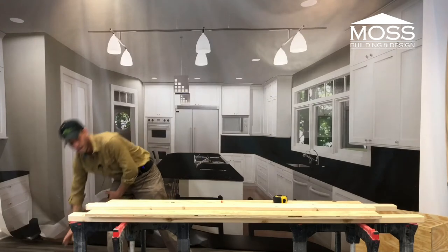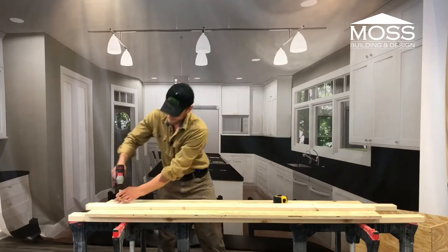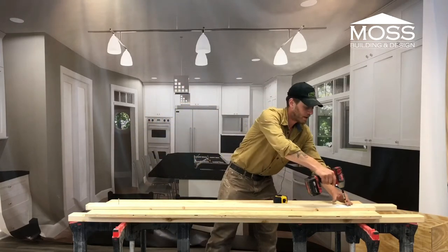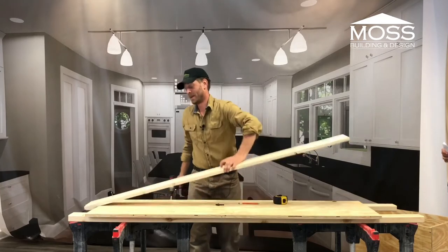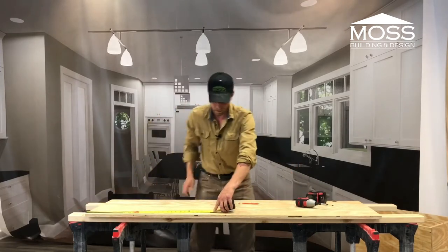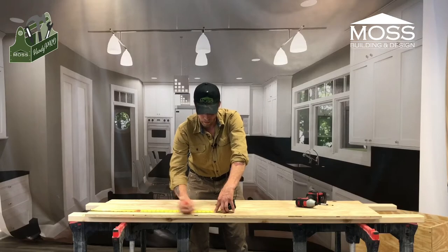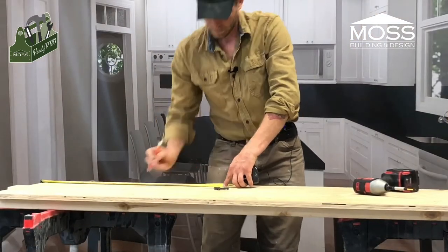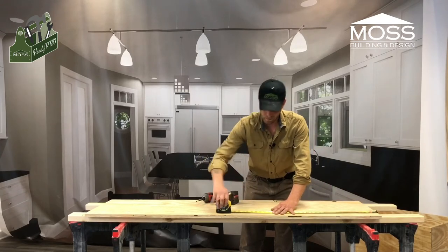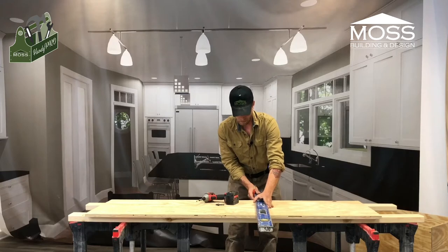We're going to do a cross cut on this plywood, and I want to talk about supporting the fall. This is a 28-inch cut, pulling from my factory edge right in the middle. When we take a measurement, we do what's called a little crow's foot — you take where the line's at and start your mark like that, kind of doing a little arrow pointing at it. Then we take a straight edge and make our mark. I'm going to cut these freehand, not set up a temporary fence. This is a four-foot level, another great straight edge to use.